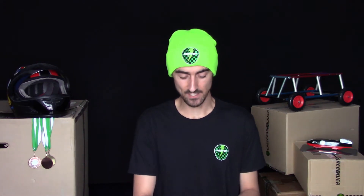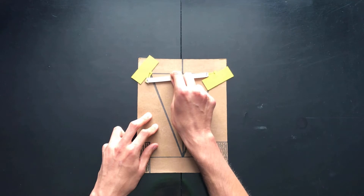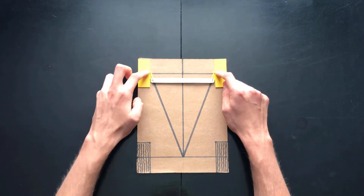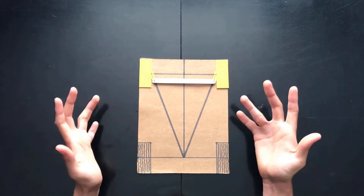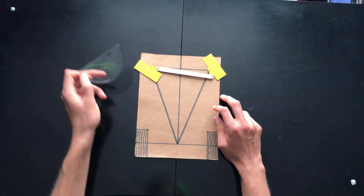This steering geometry that allows for one wheel to turn more than the other is known as Ackermann steering. It works if we go both ways — the inside wheel is turning more than the outside wheel. This makes use of each wheel having its own pivot, then being connected by the steering rack, or as we're going to call them, steering arms. I'm not going to go too much further into the definition of Ackermann steering — it gets really complicated with some formulas — but I just wanted to give you an understanding that the inside wheel needs to turn more than the outside wheel. If you want to take your experimentation to the next level, you can make a template and start measuring the difference in angle between the inside and outside wheel. In short, the stub axle has that kink in it to allow for Ackermann steering.